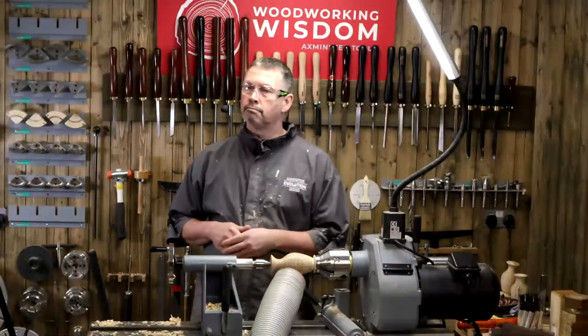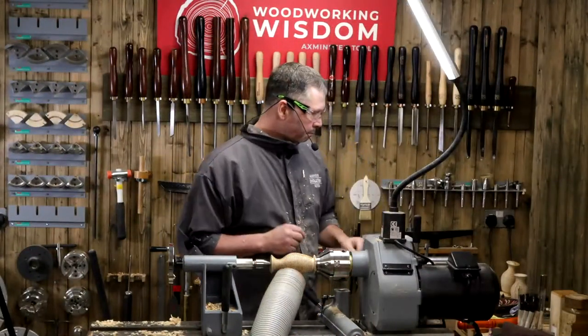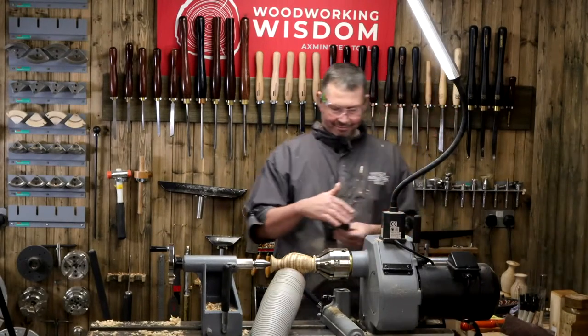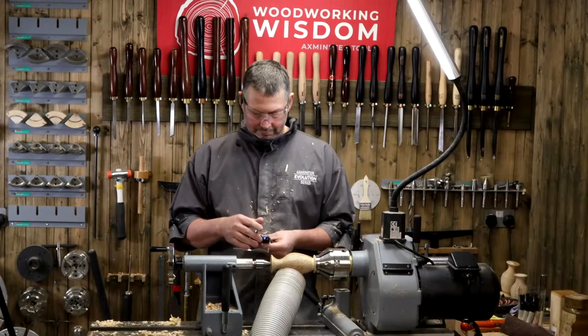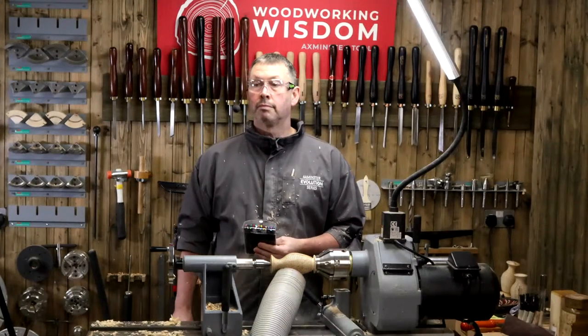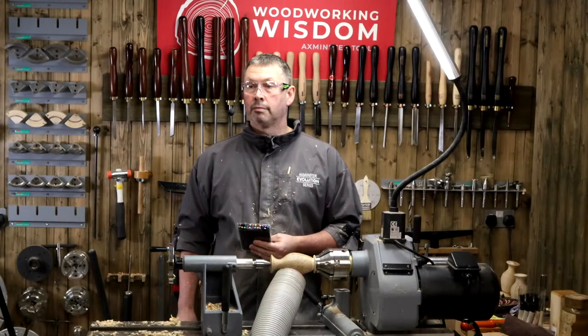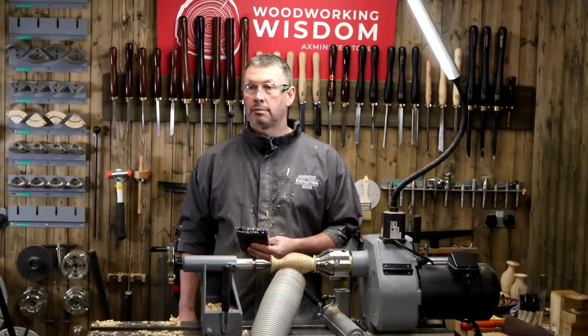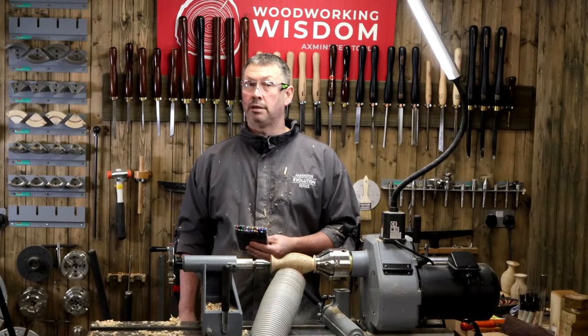And then we've got a question here from Andy. Totally off topic, he says, but could you perhaps make a download for your offset pendant? How deep you cut into the chuck plates for holding, what size drill used, and what offset or thickness? Yeah. But I think all that info's... It is. I can quickly give it to you. I mean, the offset was 10 mil. On mine, 50 mil pendants, 10 mil offset.